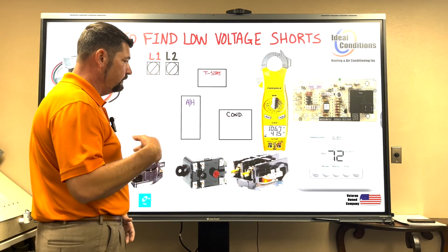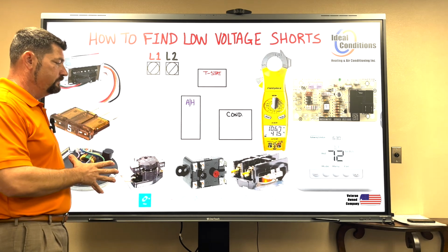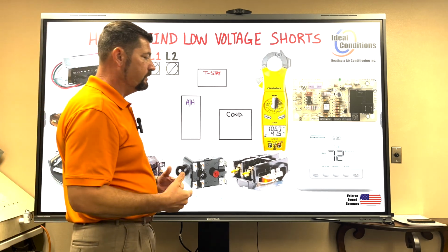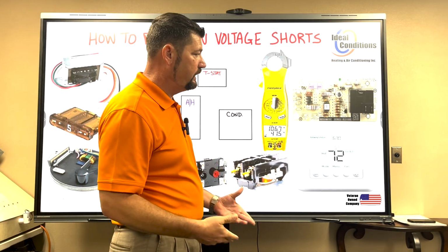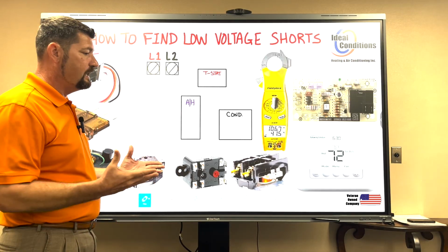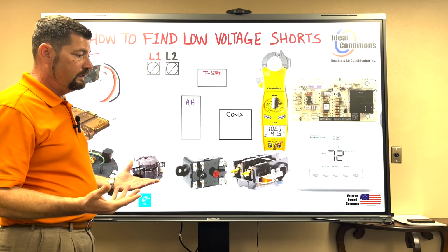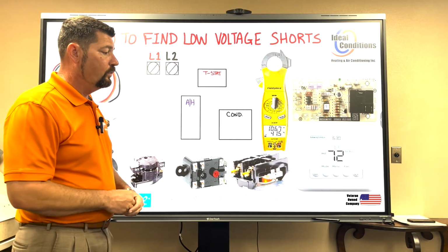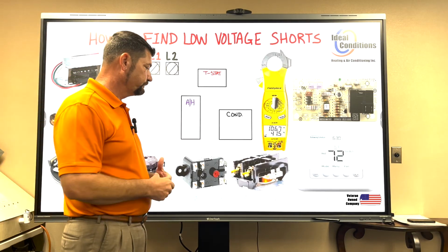And like I said, when we get into the next video on heat pumps, and after that, we're going to take this to another level. That's a little bit busier, and we're talking about a lot more loads. Obviously, heat pumps have reversing valves, defrost control boards, and whatnot. And you may be having dual transformers, and one transformer may be feeding a UV light, which would be an additional load.